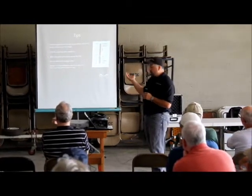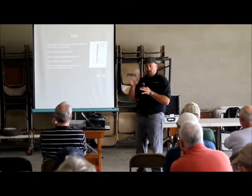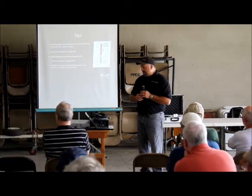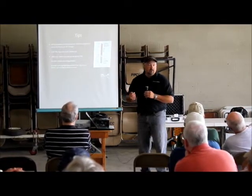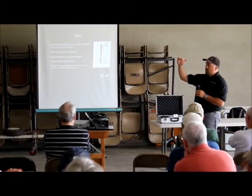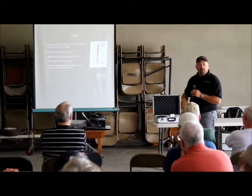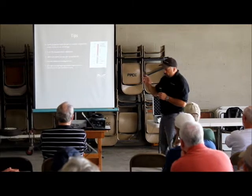If the spinner is flexible or it's a thin fiberglass spinner, things like that will cause a problem. A rough engine — if the compression is low, it's a half-per issue — it'll show up as a 1-per vibration. What you'll find is you can balance it down to a certain level and then you can't balance below that. That's usually something to do with the engine running rough when the spinner should be fine.